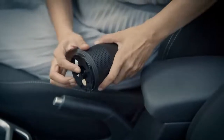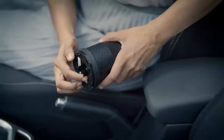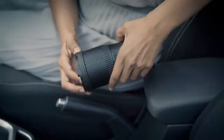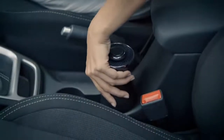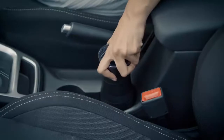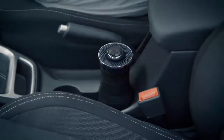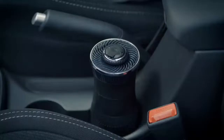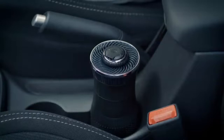Adjust the direction of the misassembly guide hole for the docking part to the direction of the misassembly guide boss for the main body. Rotate the assembled main body in the opposite direction until you hear the click sound — the click means it is locked. When assembling, always check if the direction is correct, as the misassembly prevention design can cause damage if assembled incorrectly.